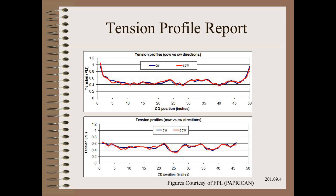This particular plot shows tight edges. However, we must be aware that many sensors, not just tension profile sensors, have end effects. One example is online scanners often show a smile or frown tendency that might not really exist — they are an artifact of imperfections in the sensing system itself. Note in the case of the bottom plot, how a more uniform web does not show the smile shape, thus giving evidence that the measurement is good right up to the very edges.